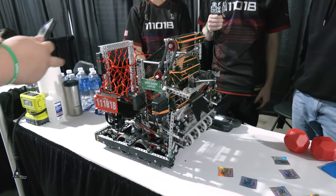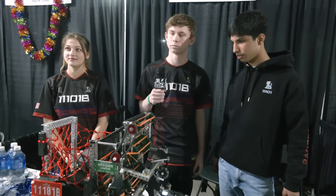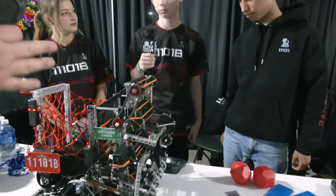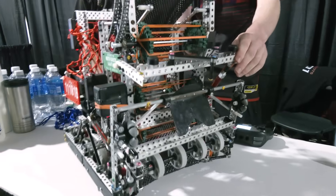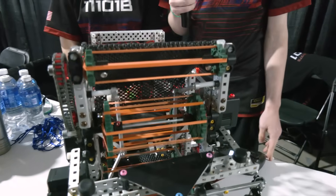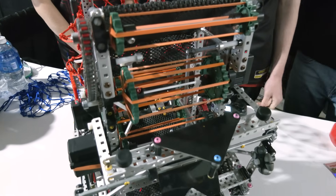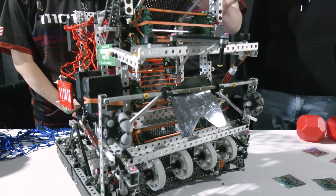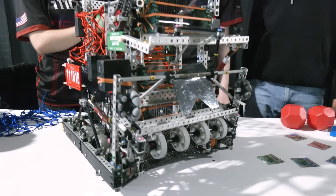I love that you're bringing the best of all worlds with this. We've seen many different robots and you're bringing all those robots together. By adding that extra complexity though, are there any potential issues with balls jamming or things you've had to mitigate with having three separate systems? We've had a few times the balls have jammed, but we implemented a funnel system with standoffs here to make sure the balls are always in the center so they don't get jammed off to the side. And the system is actually a bit less complex since you don't have to chain or gear the whole intake together — a lot less chaining, a lot less gearing.